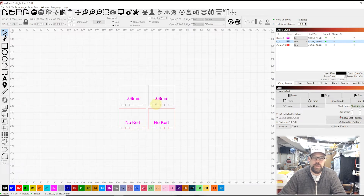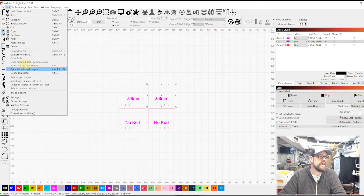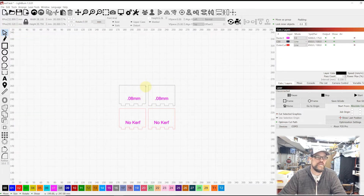Here's a caveat: if you're drawing within LightBurn and using shapes, great. But if you're importing objects, make sure they are closed. If an object isn't closed, LightBurn won't know how to offset it because it looks for the outward direction from that object. You can highlight an object, go to Edit, and select 'Auto Join Selected Shapes.' You can also use 'Select Open Shapes' to find any objects in your drawing that aren't closed — check that before running this test.